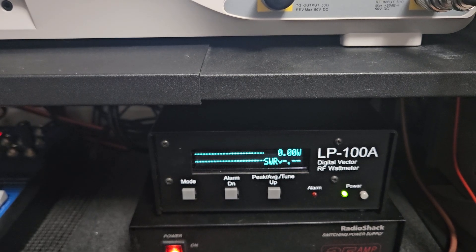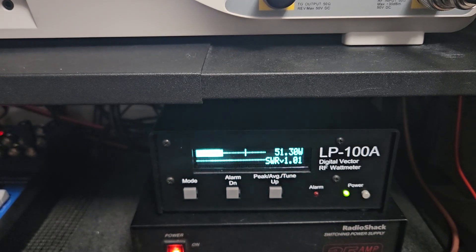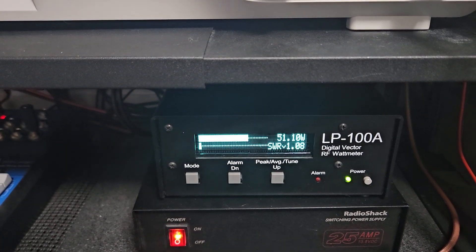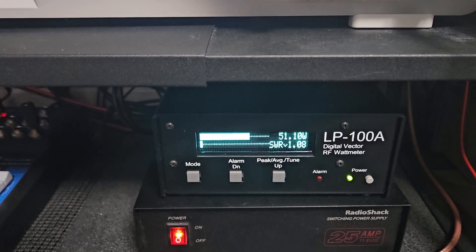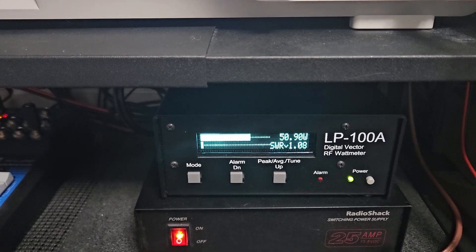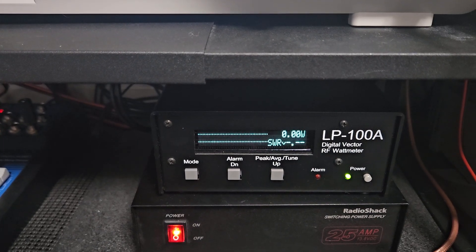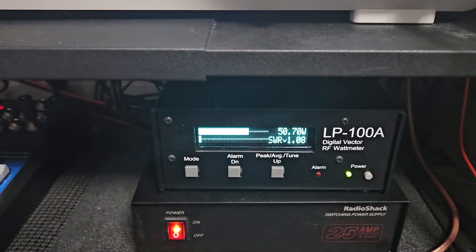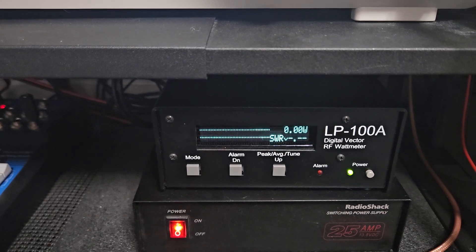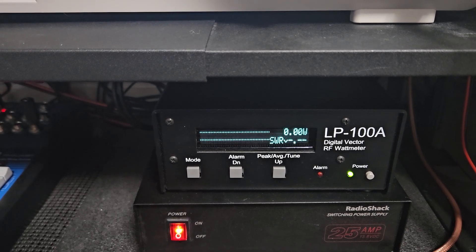There's FM power at about 51 watts. You can hear those fans draw back on the current — we're drawing about 8 amps on my RS70 power supply. It'll go all the way down to 1 watt if you choose to lower it. I think with this radio you could probably run full duty cycle at 50 watts continuous, due to the fans keeping it cool, as long as you're not transmitting for 10 minutes straight. But again, that's just my interpretation with the fans helping cool things.